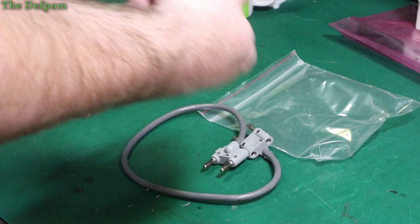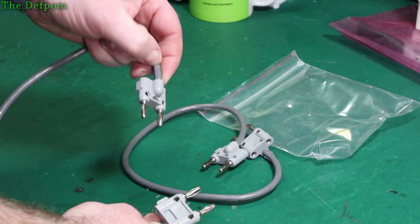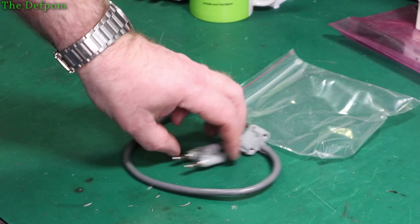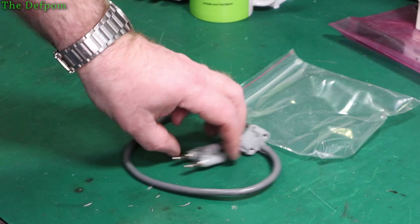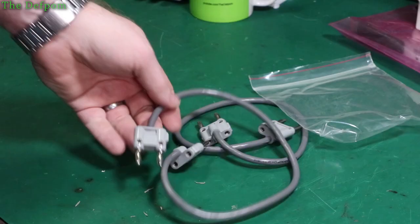So I've got two short ones. What I might do is just hook these up and check the resistances of the cables and see if there's anything obviously dodgy about them. But the quality doesn't seem quite right — I'm just suspecting these are fakes. I'll plug it into my multimeter and it's showing a really good resistance, basically showing zero. They're probably fine. I'm probably just being a bit fussy about it, but yeah, suspicious.